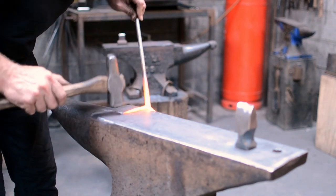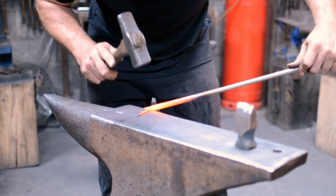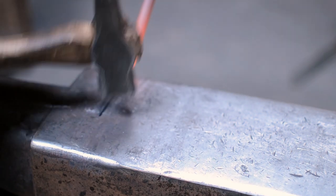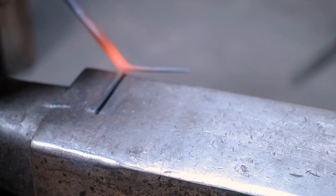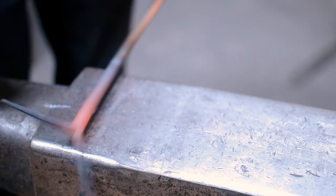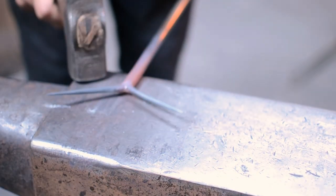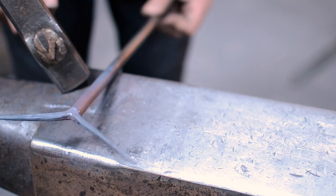One of the challenges is that we make the forks out of stainless steel. It's not necessarily more difficult to forge than normal steel, but it is a different type of material, so you need a slightly different mindset when approaching it. It does forge differently, especially when you're forging out the tines and splitting things. You definitely have to remember what material you're working with. We forge stainless and get that lovely black finish, but because it's an eating tool, it doesn't go rusty.